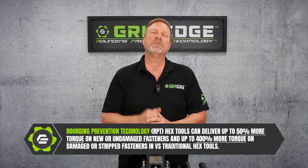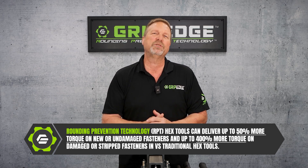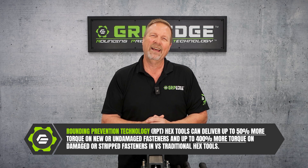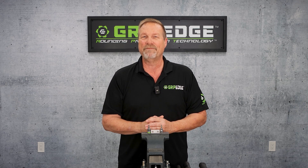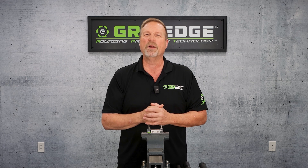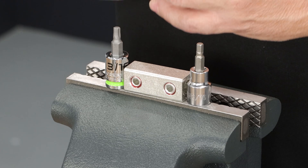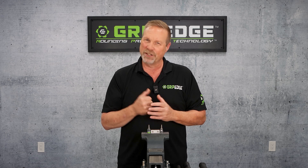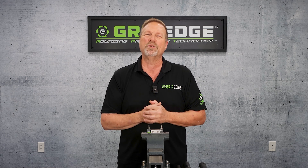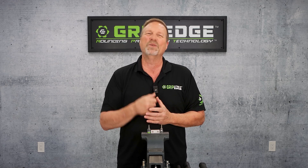Let me tell you a little bit about the demonstration we have today. On social media I see comments all the time like how well does your tool work on red Loctite, and also how well does the tool work on softer fasteners like aluminum? Well today we're gonna have a look at both of those questions. In front of me I have an electrical aluminum block, and in that block there are two 3/16 hex head fasteners. I've red Loctited both of those in and they've had overnight to cure — they should be good and tight. We're gonna use both of our tools: the standard conventional on one side and the RPT on the other. Let's see which one does a better job.